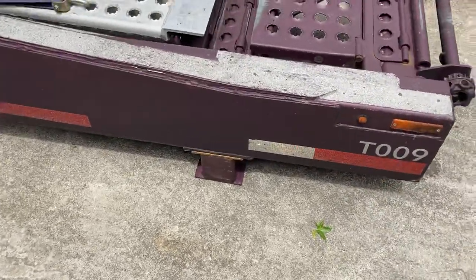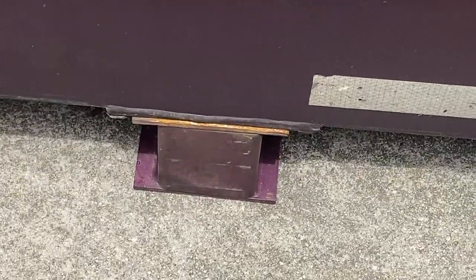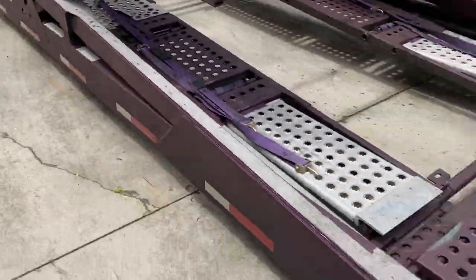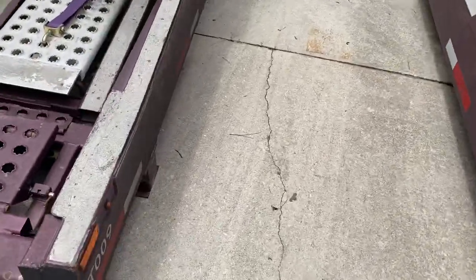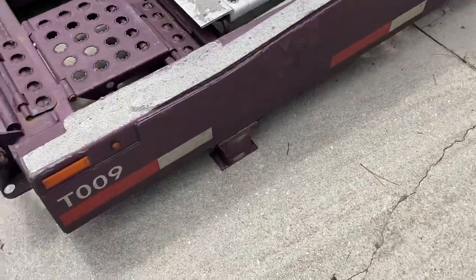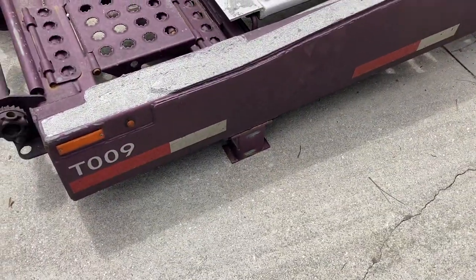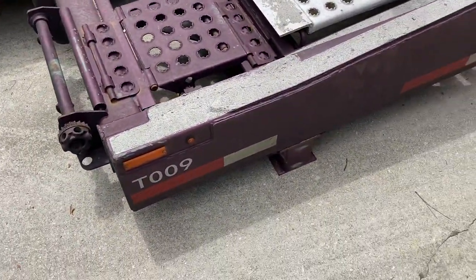This is your landing gear. That's your landing gear right there. So the trailer sits so low to the ground already, these car haulers, you don't have any landing gear. That is your landing gear, just those little stakes right there. That's all you need. You just stick those under there and let your airbags down, and it'll sit on top